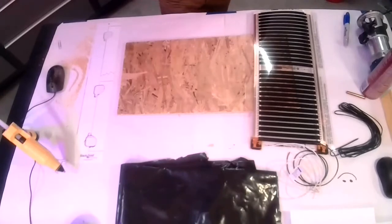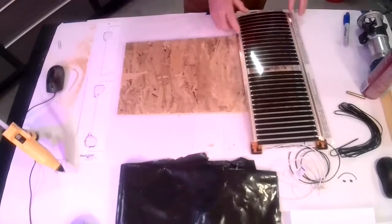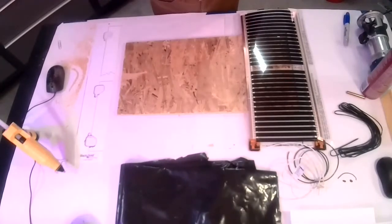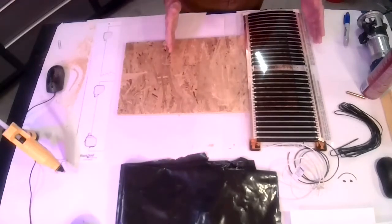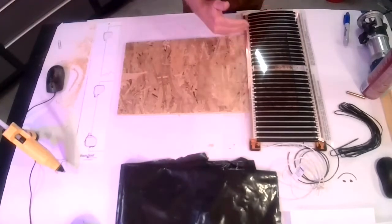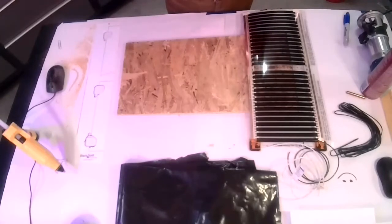So black gold. What is black gold? It's a lightweight carbon-based film intended to go under primarily floating floor, but anything else that needs a thin, no buildup, something to provide radiant heat. Comes in 10-inch, 20-inch, and if you go to 240-volt, 32-inch widths. And we cut it in 10-inch increments. So it's going to be cut to fit the space the way you lay out the panels.